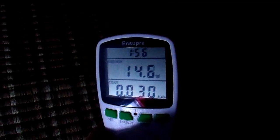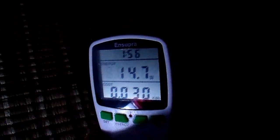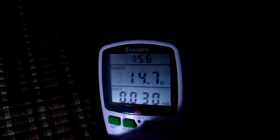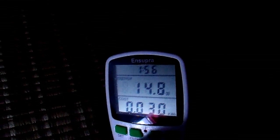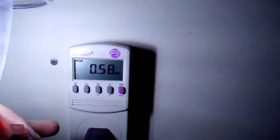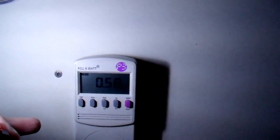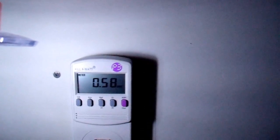I've been running off of battery power for about two hours. This particular phase is still only drawing about 15 watts, and at the bottom you can see it's 0.03 kilowatt hours — very low. The other phase is currently drawing 90 watts — I shut off most things in anticipation of switching back to regular power. Going to kilowatt hours, I've used about 0.58 kilowatt hours on this phase, so about 0.6 kilowatt hours in the last two hours, or about 300 watts on average.